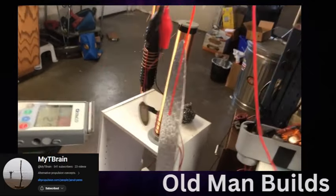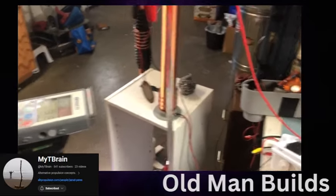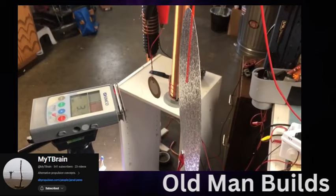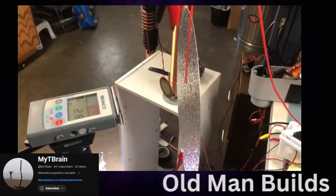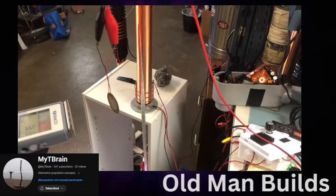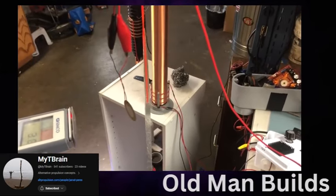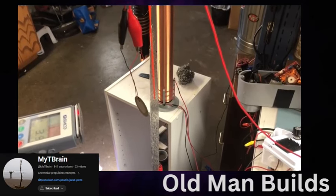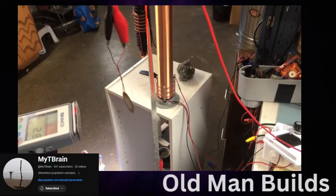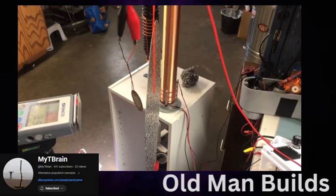When I push the button it releases the static charge that has built up on the piezo. I've observed that when I push the button I'll see this go positive about a couple hundred volts. When I had the negative attached to the big disc, it would lose a little bit of its negative charge — going down a couple hundred volts, like from negative 2 kV down to negative 1.6 or 1.7 kV. It seems like pushing it grounds out the piezo and makes it easier for the piezo to get attracted.